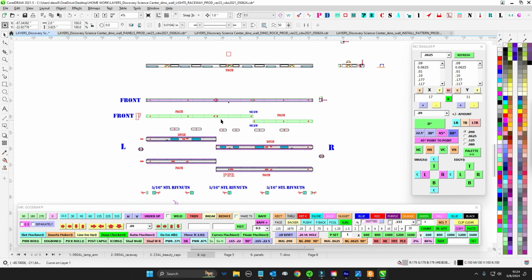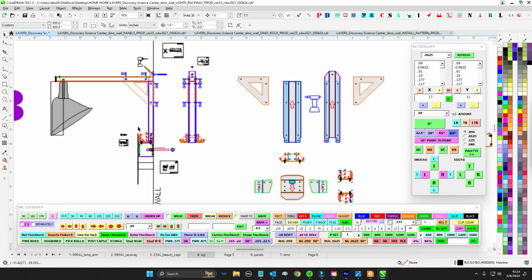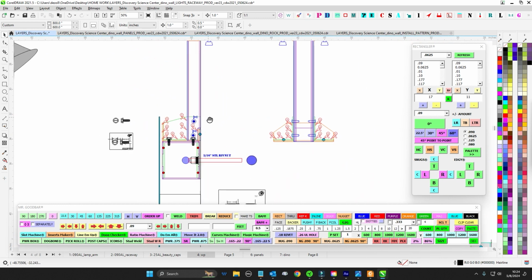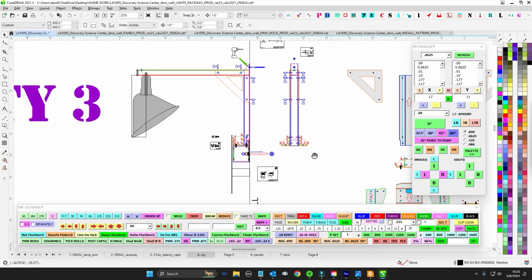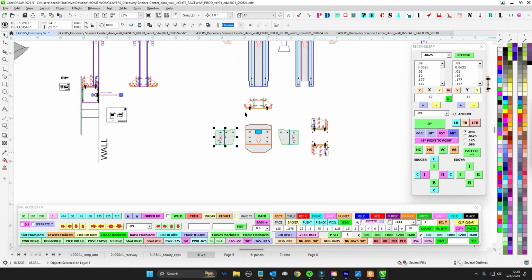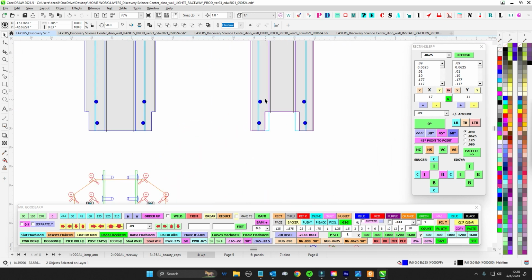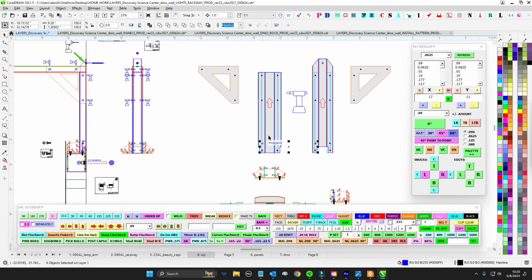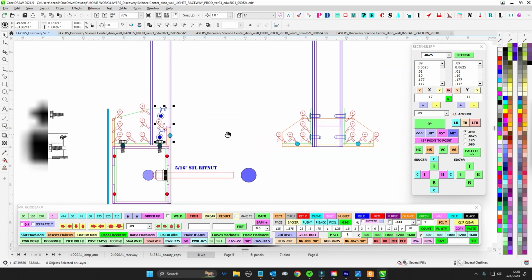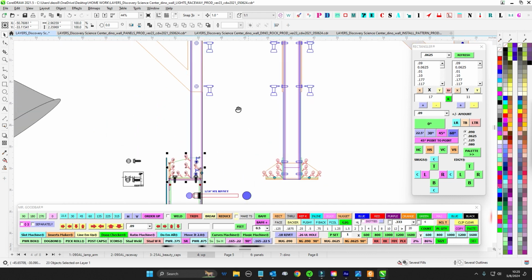So once you get this all built up and it's basically good to go, we've got to finish this up. So when it comes to the base, how low can you go? You're going to take this base here, you're going to fold this up, and you're going to do these two guys on each side. They're going to cleco in here, and then you're going to rivet here and here. You have two rivet holes, and they're going to rivet into the sides of the vertical arms. So it's going to create this whole little arm leg thing, and that's how this whole one piece goes.